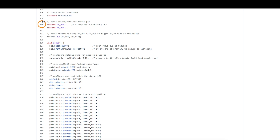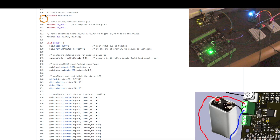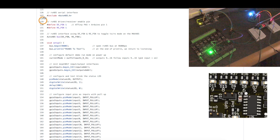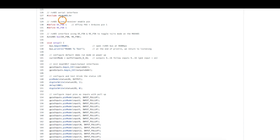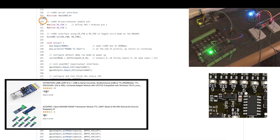I made a demo sketch which I gradually added functionality to, starting with RS-485. The ATtiny is programmed using UPDI, so I used an Arduino Uno as a UPDI programmer. This driver board must be powered from the main DC supply while programming — I didn't set it up to allow being powered from the programmer's 5 volt supply, so only the UPDI programming pin and ground connect to the programmer. Using the AUTO-485 library, I ran a test where the board sends a greeting message over RS-485 on power-up, connecting through an Arduino RS-485 module and USB to TTL UART interface to the Arduino IDE serial monitor.